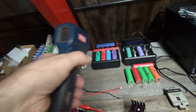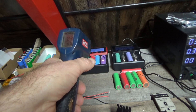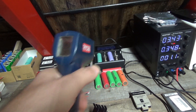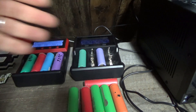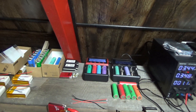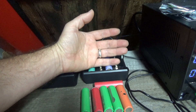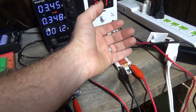As I work I'm always checking temperatures — 79, 83, 82, 76 — keeping an eye on everything. One's a little high but it just finished its discharge cycle. I can also feel the batteries; if it doesn't feel bad to touch, that's okay, but if anything feels hot or checks out high with the laser at any time, it goes out of here. I'm constantly throughout the entire cycle feeling the batteries and hitting them with the laser. These Samsung batteries are amazing.